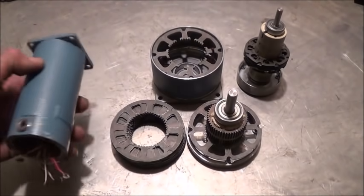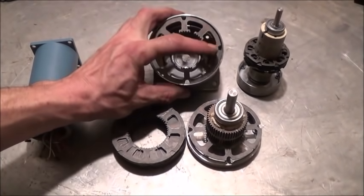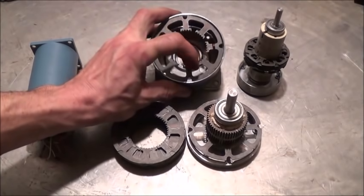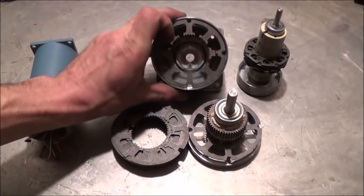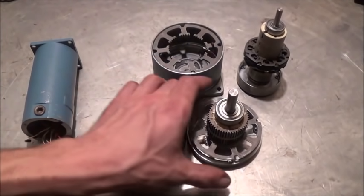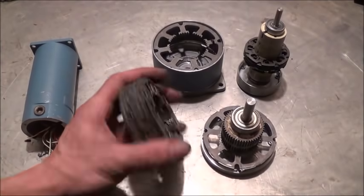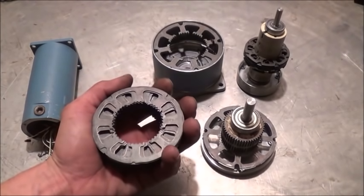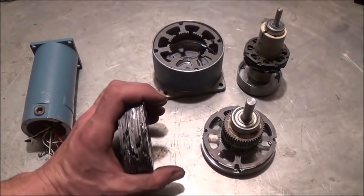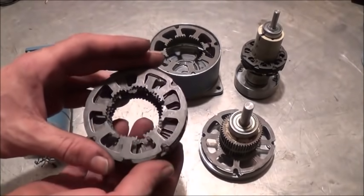What we're going to use to do this is these stepper motors. These stepper motors have a bunch of teeth and they have a stator and a rotor in there. The stator is the part that sits on the outside like this, holds all the electromagnetic coils around it. These would have had the copper wire coils wrapped all the way around. And the rotor would have sat right inside the center of that, which this piece right here is the rotor. We're going to use these laminates — laminated little sections of steel that are all pressed together — it gets rid of the eddy effects inside of electromagnetics. We're going to take these, now that I've separated them all, and build a little tiny Tesla turbine that should produce incredible amounts of power because of all the little teeth that are all over on these things.